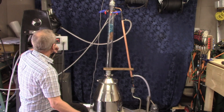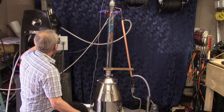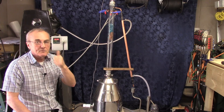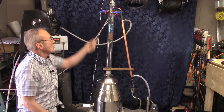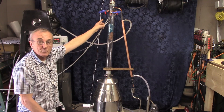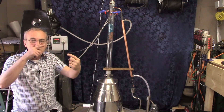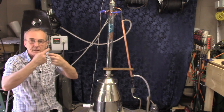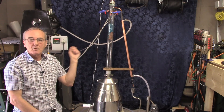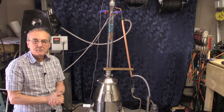Now I'm at 149 degrees and I've got it set for 158. I'm going to bump the temperature up, but right before I do that I'm going to turn on my pump that controls the water flow through the reflux chamber. That's nothing more than three copper pipes that run through, giving it a place to pre-condense. I'm going to turn that on, adjust the water flow, and show you that. Then I'll turn the temperature up.